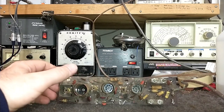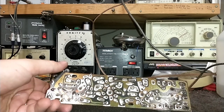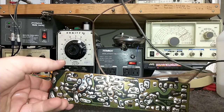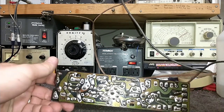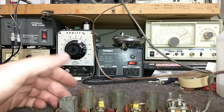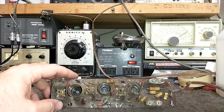What I'm going to do is take some CRC-QD — which has very quick drying solvents — and spray down the board, then we'll get to replacing components. The back side is actually really good-looking, still mostly green, not much heat buildup. The tube sockets are still well-soldered, but I'm going to replace them because these sockets become problematic. Two were excessively tight and the one on the far right was loose, so definitely not leaving those in.